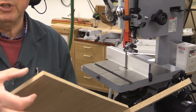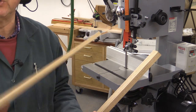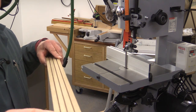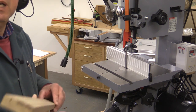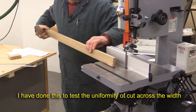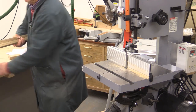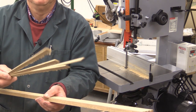I need to cut out some thin strips — about 10mm wide and about 2mm thick — to go around the edges of the fronts of these pull-down drawer flap things. I thought I'd try a quick way of doing it, so I very quickly put some rebates in this piece of wood, just over 10mm across, and I'm going to run it through the bandsaw. I've got it set for a very thin cut. There we are — a whole bunch of very neat little pieces. Perfect.